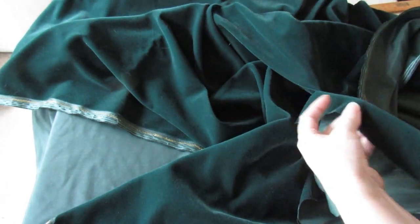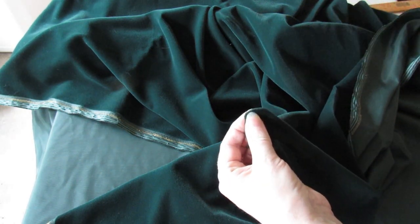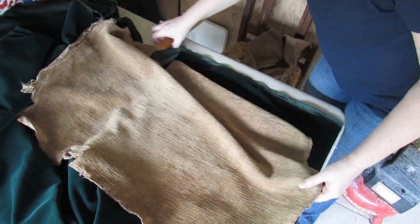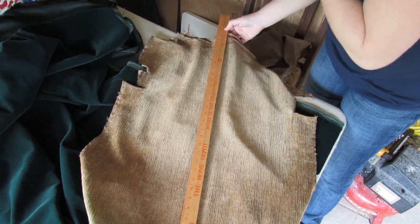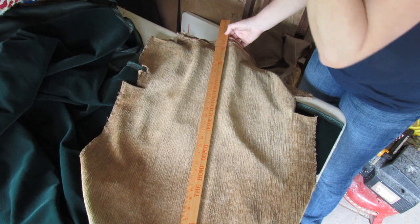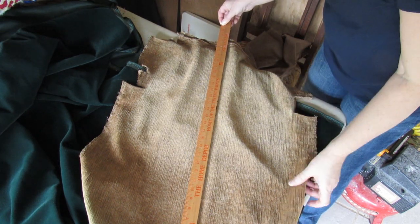Having decided that that's down, I'm going to put a little nick on the top here. From now on the bottom of the V shows down. Now this was the inside back of the chair that comes to just under 33 inches. I need it to go a little bit further over the top and under the bottom, so I'm going to cut that at 35 inches.